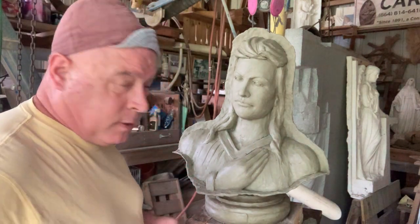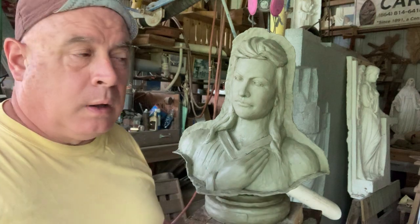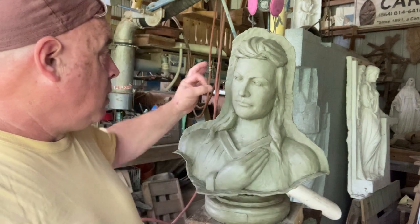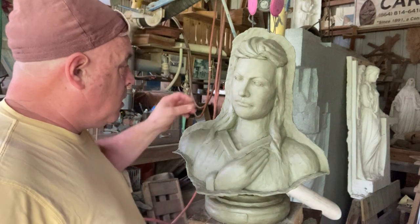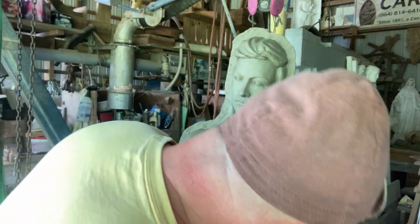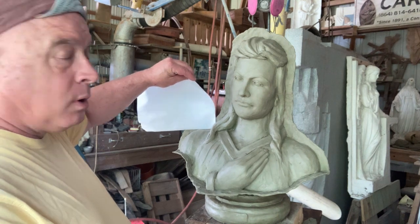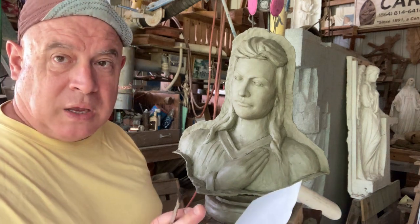Because we've got a relatively complex mold, we're not doing one that has a straight parting line around it. It's not as critical to go through and take your tool and cut a cup like half a ball to where they register to go together. It doesn't hurt, but it isn't really necessary. And what we're going to do, we'll put this together and we'll build this side, and then we'll have to build the other sides, is I'm going to take paper and line all of this parting line with paper that cuts and fits right up to her or even goes in just a little bit. And then when I put the silicone on, the silicone will adhere to this, okay?